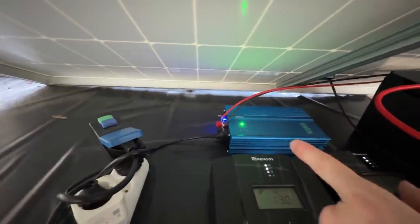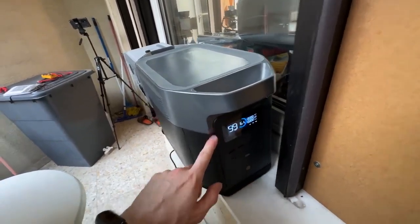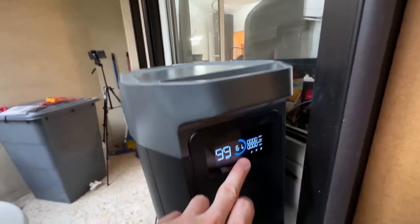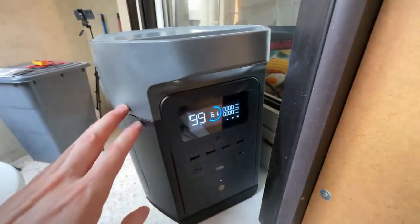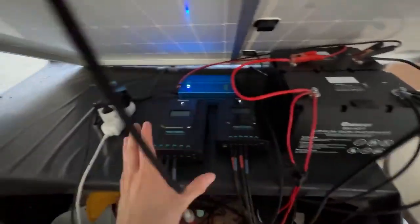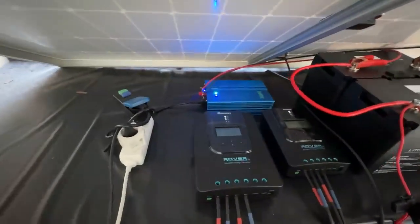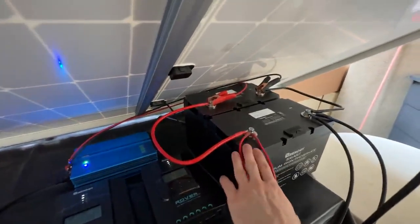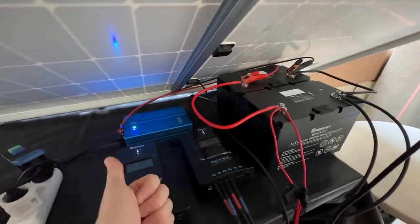and reset it. And I've dialed in this one with this power bank. I've just hooked up the car jack, you know, the cigarette lighter, to this, and then this has an output measurement right there, and it's not easy to dial it in perfectly, but it's on the very low side at around 50 to 60 watts of power consumption. So that's the gross, so it will draw 50 to 60 watts from these batteries, so they should last at least 24 hours, and I'm totally fine with that.